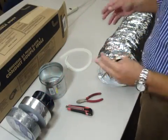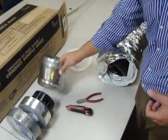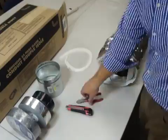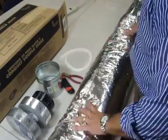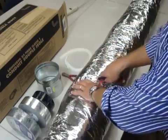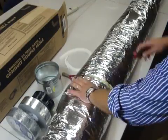What I'm going to do is demonstrate the most complex of the installations, which would be a free-floating end-to-end connection for flexible duct work. To do that, we obviously need some flexible duct work. I'm going to cut the duct work in a spot — this is pretty straightforward. Go through here with your knife and just cut into it, kind of like a piece of bread.